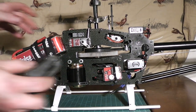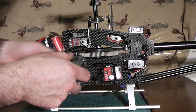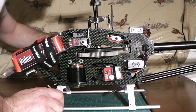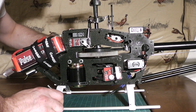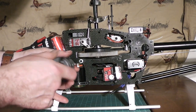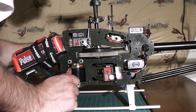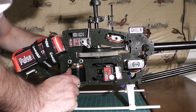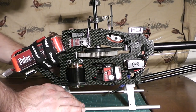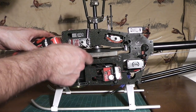What I'm going to do is just tension down the bolts just a little bit. No loctite at this point because we're just trying to set the main gear mesh. You don't want these really tight — you just want to finger-tighten them using the X pattern that we've talked about before. Go opposites — it helps to keep the motor square. So we want to tighten her down just a little bit, like finger tight. Now that I've got that set and it's fairly tight, I can definitely distinguish the high spot.